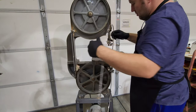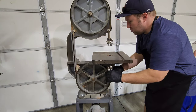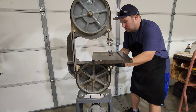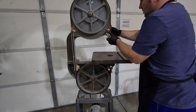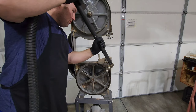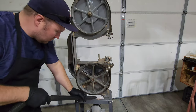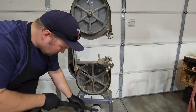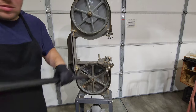Right here we're going to take the saw blade off — it just makes a 90 degree turn and we pull it out of the slot in the table. Now we need to remove the table to access the blade guides on the bottom. That's done by taking off the two hand nuts that are underneath the table, and then you can lift the table directly off. There's usually quite a bit of sawdust built up on the bottom guides, so it's always good to go over with a vacuum cleaner and just clean it up. Clean machinery usually runs better.